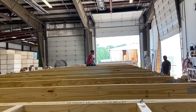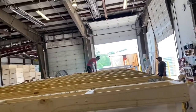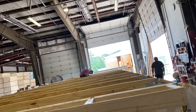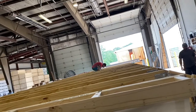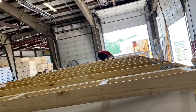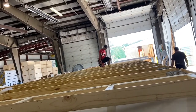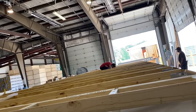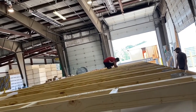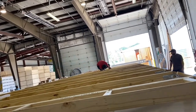Yeah. And that's what's key, if your foundation contractor can get as true and accurate a foundation as they can, because when you're site building, you're building to an inaccurate foundation. Right. Here, we're building on a perfectly flat surface, like that deck right here. So if you got a bad foundation, the weight of that house will settle down on the deck. So a lot of people like to blame, oh, it's modular, it's the reason I'm getting cracks in my drywall. No, it's because your foundation wasn't really dialed in. So that makes a big difference.